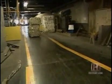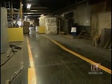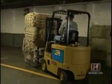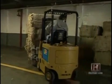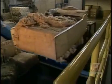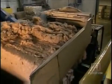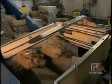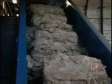Paper currency must endure a lot of wear and tear, and paper made from wood pulp couldn't survive the abuse. The fibers in wood pulp are not as long and not as strong as the fibers in cotton. We have nearly pure, highly crystalline cellulose in cotton, so it's much stronger, more brittle, a rattle in the paper when you move it, a crispness, all those characteristics that make U.S. currency paper so distinct when you feel it. Achieving that distinctive feel, which counterfeiters find very tricky to duplicate, is the result of a time-honored and painstaking process.